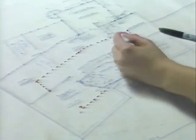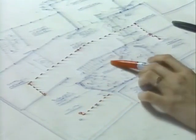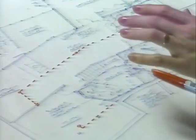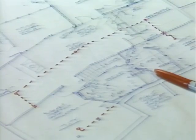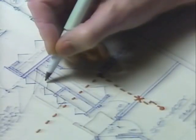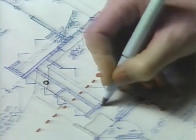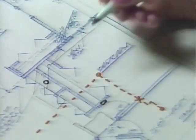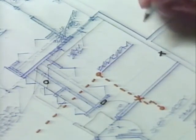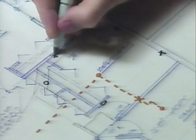We identified the 2 existing 15-amp circuits that currently supply power to the overhead lights and wall receptacles here in the basement. And by planning for the use of each room, we'll mark for the additional switches and receptacles that we want to add. Here in the closet, we'll add an overhead light, a wall switch here. This is an existing outlet, so we'll put an outlet here, here, and another here.